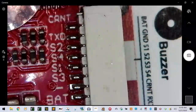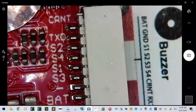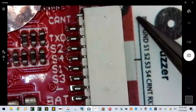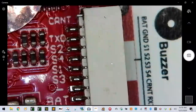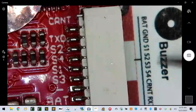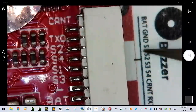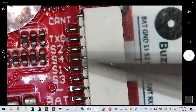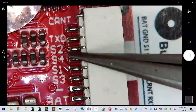Obviously the cable that they give us basically inverts it — we understand battery here matches battery here, and ground matches ground. Now the ESC signals don't match at all — this is just ridiculous. Here they went in order and here they went all over the place. This matches more like the JHEMCU version.